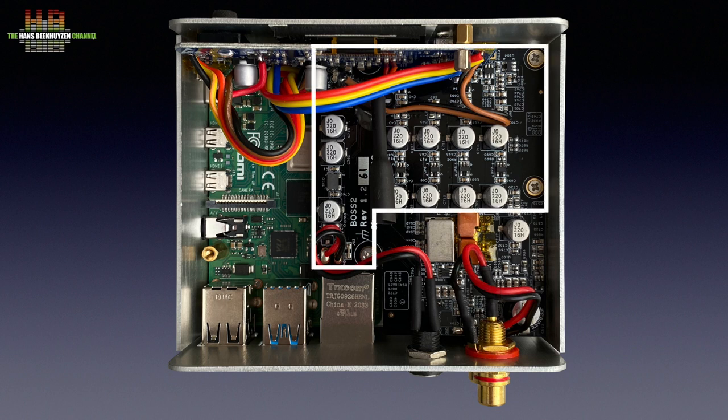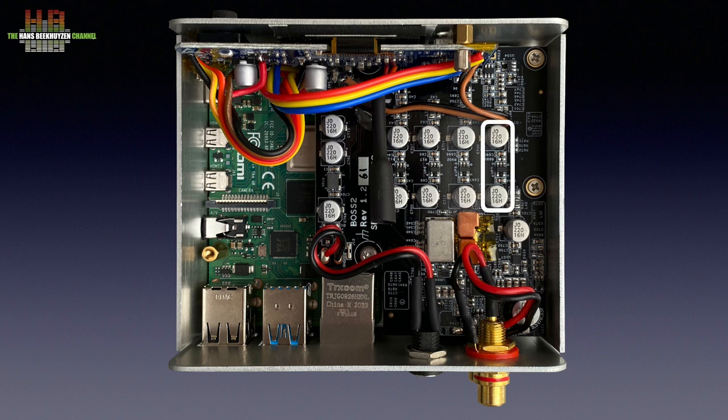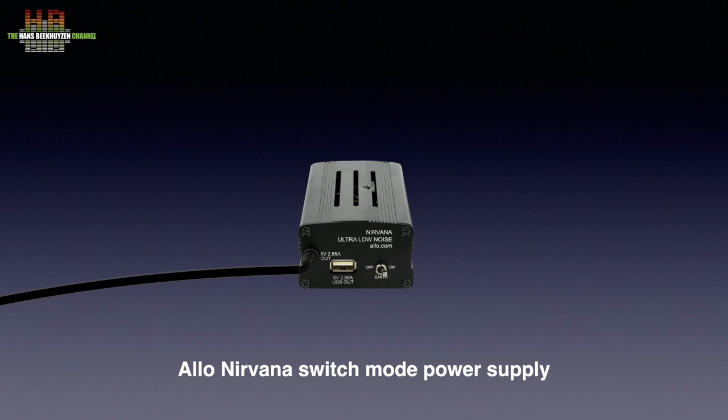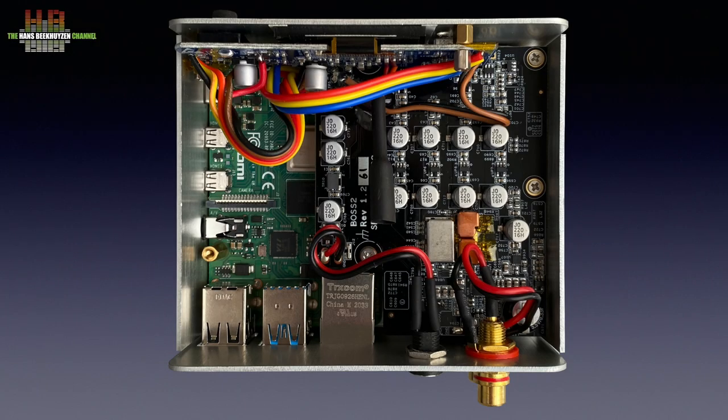The larger part of the board holds the 30 low drop-out regulators, many filters, and two supercapacitors. The power input on the rear is filtered with common mode chokes — this is the power input you normally use, since it filters the incoming DC voltage and sends it through to the Raspberry Pi. I reviewed it this way using the Allo Nirvana switch mode power supply, included in the ready-to-use price of €215. I also tested the dual power mode, where the Raspberry Pi is powered separately — to do that you remove the jumper hidden in the heat shrink tubing here.